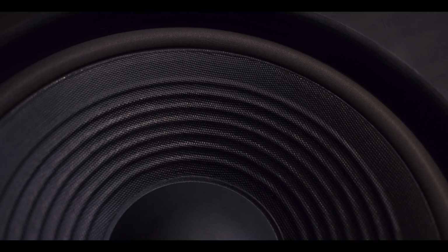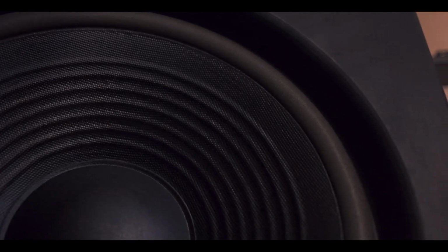On the side of the speakers, we find 12-inch drivers. There are a dozen per side. These are the integrated subwoofers, which are working below 60 Hz. The front speakers, which you see here, they are not limited downwards. They are acoustically limited by the open baffle. So we use the crossover, which is as simple as possible there. For the drivers on the side, we use the DSP, which we mainly use as a frequency crossover.